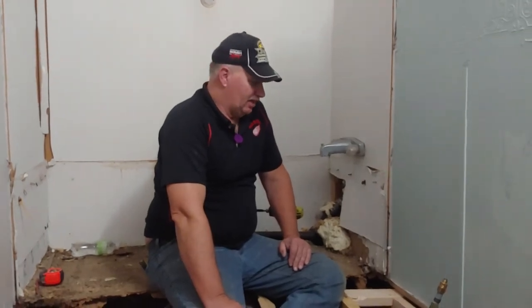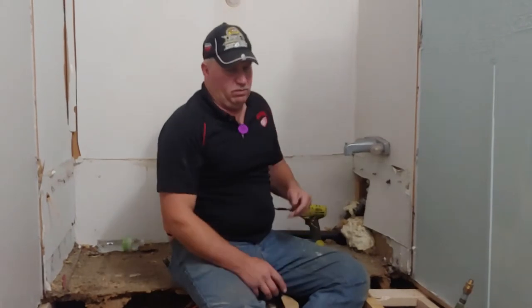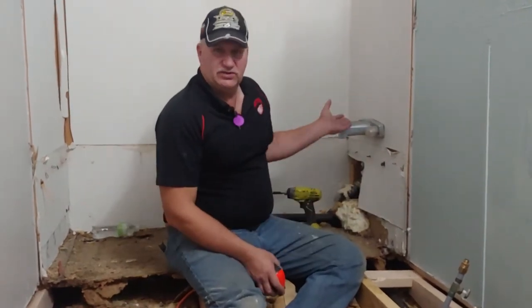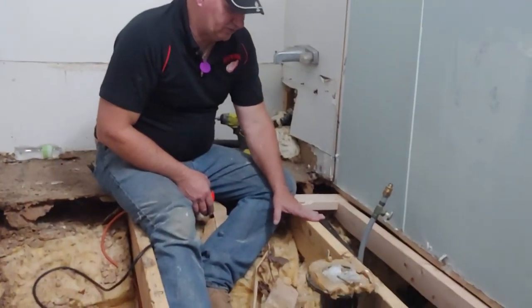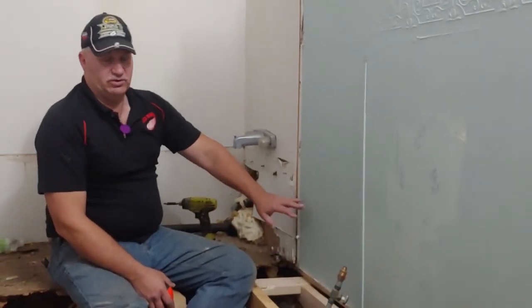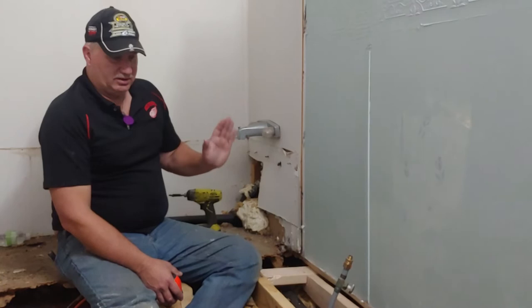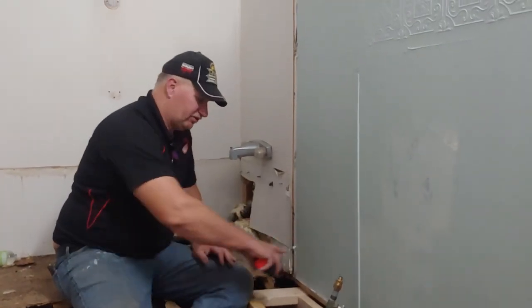I'll give you a little cheat sheet for what I do. I know that about 30 to 34 inches from the outside wall — about 30 inches from the inside wall — there's a frame that runs the full length of the house, and where those two halves meet it's the same thing. Basically it's a little less than eight feet across most of the time. In this case a two-by-four or two-by-six was on about 22 to 23 inch centers. I could cut a little slit in the floor so I can get my head up in there, go underneath, and fasten on both sides — board all the way across and then run over to the other one and toe-nail it.